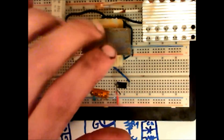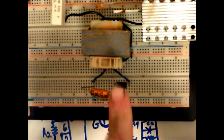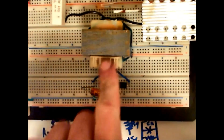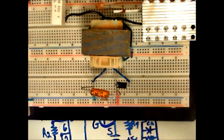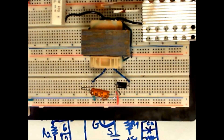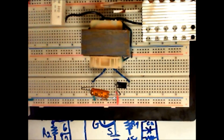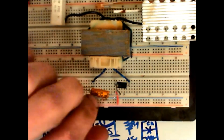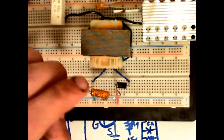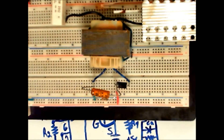Another warning about transformers: inductors store current just as capacitors store voltage. So when you use big inductors and disconnect them from a power source, they still hold current — they don't just dissipate like a resistor or other discrete component. They actually hold that amperage in there, so the legs on these inductors are hot for a period of time after disconnection, just like we saw in the RC video where the capacitor stored voltage even after it was disconnected, like a battery.